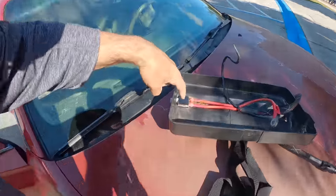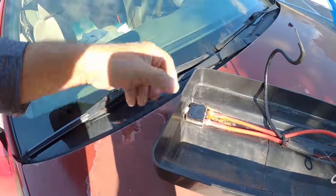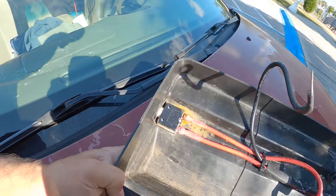So here's the deal. When I store this kayak, I always leave the battery box in there and I flip the kayak upside down. So what apparently was happening is any salt water that had gotten inside that battery box, when I flipped it upside down, was probably dripping on that connection, running down the wires or whatever, and caused it to get corroded. But the motor not found issue has been solved. All the electric connections are working the way they should. Thanks, Old Town. Good job.